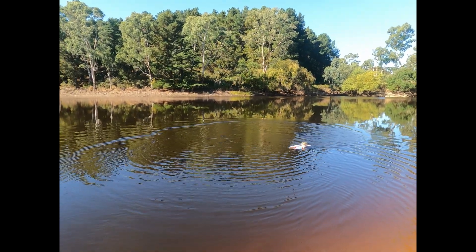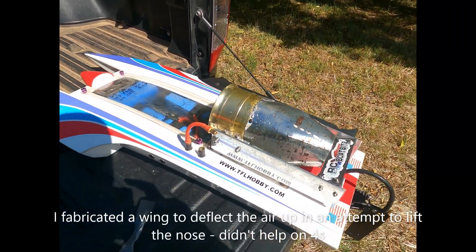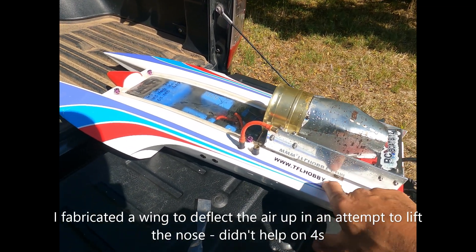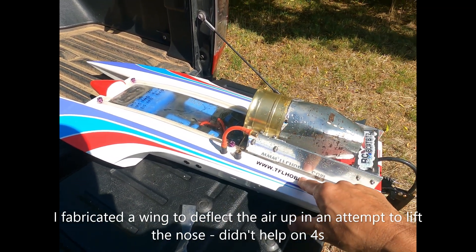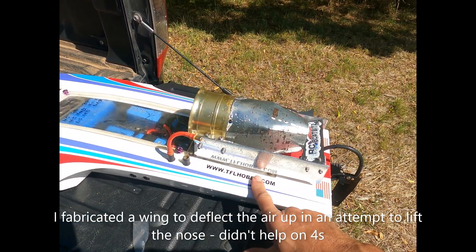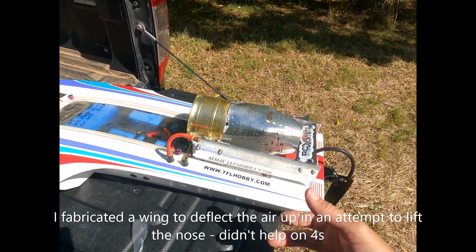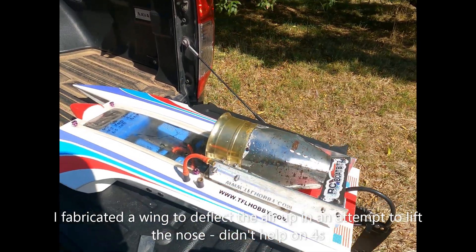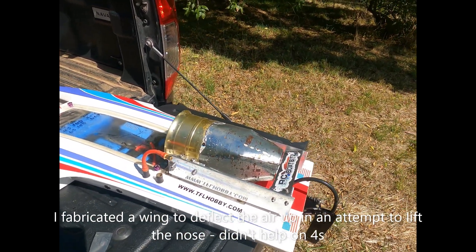Closer, but it's not happening. While I'm here I might as well flatten the batteries and try everything. So I've just hooked up the batteries on 8S — gone to series instead of parallel. This is how you blow stuff up, but maybe it can get the nose up with the extra power — we'll see.